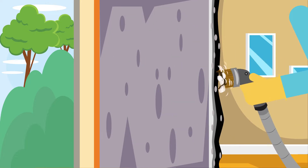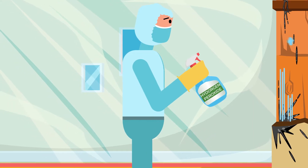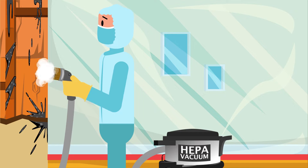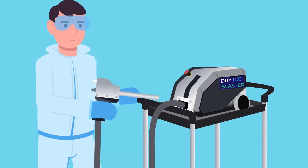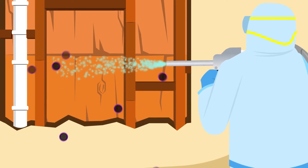Personally, my favorite way to do this is to use hydrogen peroxide to help bring everything to the surface, then by using a HEPA vacuum with a bristle brush attachment, brushing and vacuuming simultaneously to help remove these particles efficiently. Other methods include sanding, wire brushing, or even more mechanical abrasive methodologies like dry ice blasting.